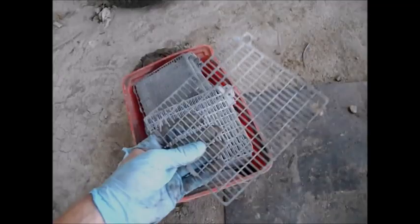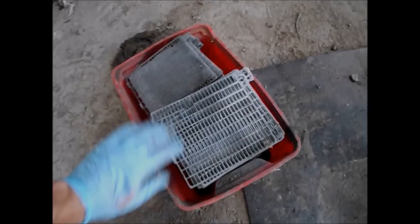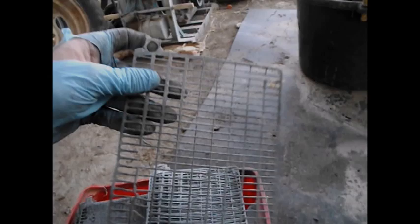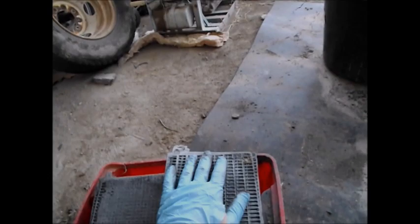What I do is take out all these lead plates and save this red oxide. I'll use it to paste the plates - mix it with a little bit of sulfuric acid, make it into a paste, and press it back into these, which used to be negative plates that I've knocked the powder off of. It's a very messy process. You do that so you can store more power, because the higher the surface area, the more electricity you can store and the faster you can discharge it.